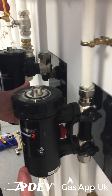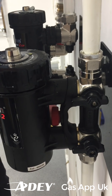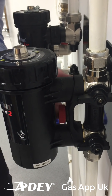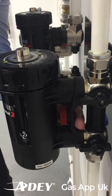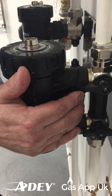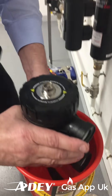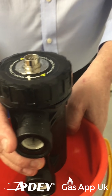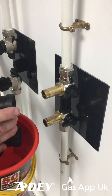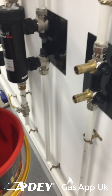So we've now drained the vessel. We're now looking to retract the filter. One of the most important things to do is on the back here, we've got a trigger, and there's a little red wheel. We can see that at the moment it is round right against the chamber, so we need to wind that away - and you should be able to do this with your fingers. You can see now we've got movement on the trigger. With that, we can then pull the trigger in and you can hear a little click there - and it pulls off. Nice and easy. The beauty of retracting the filter in this way also, if we're stuck for height - boiler above the filter, we can't get the top off - we can retract and carry out this full service, because it's important we get the service right.